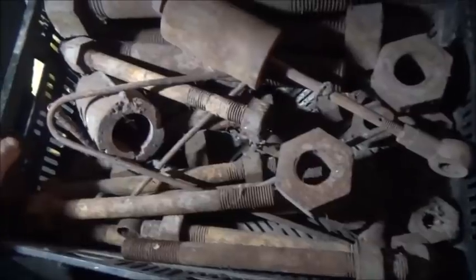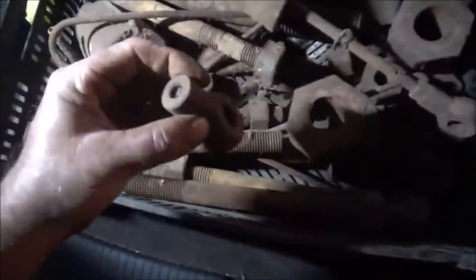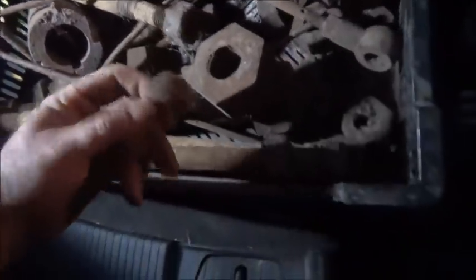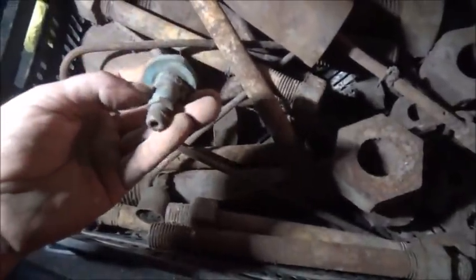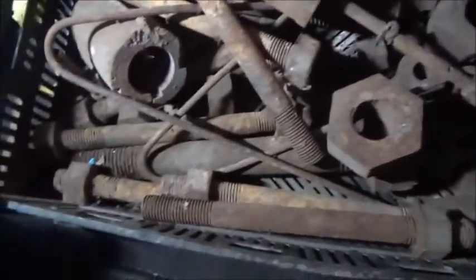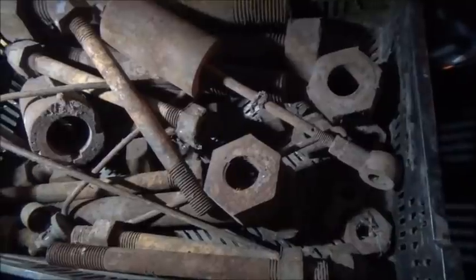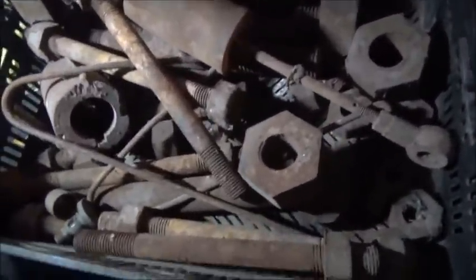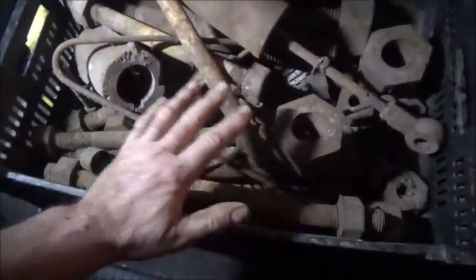All this stuff will have to be cleaned up and sandblasted - it's been sitting in a crate in a barn for a long time. We're slowly getting it together. That looks like an end off part of the linkage. There's also a drip oiler and a grease cup - it would have had a cap on top to tighten down and push grease in. There's another piece that goes on top of the engine where the governor actually mounts, and it was on the engine in the pictures.